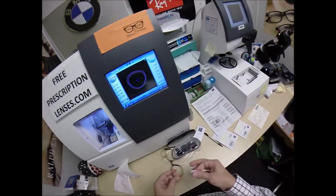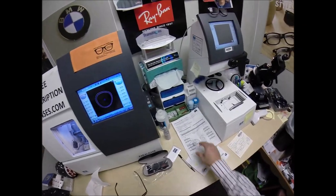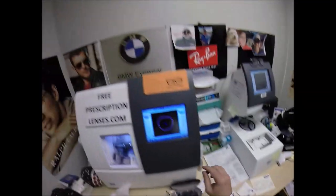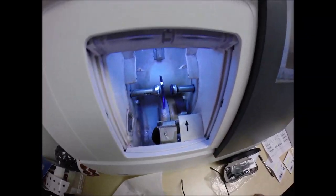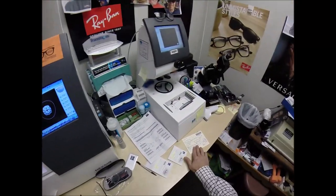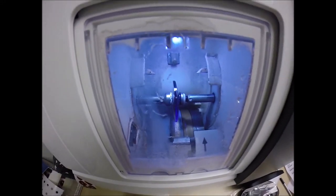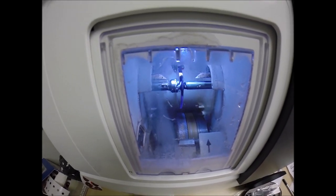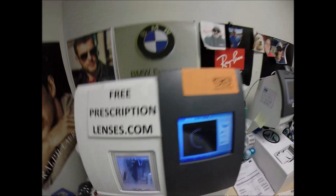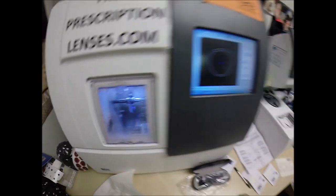Dry everything off. Tuck the lens in at the outside corner, push around — it snaps right in. We're going to move on to the left lens. Place the magnet into the chuck and hit the start button. Just like before, the door closes, the clamp shuts, and the lens is going to be traced again by the two white styluses — first making sure the lens is large enough to fit into the frame, and then measuring the thickness to know where to place the bevel for the least amount of edge thickness showing.